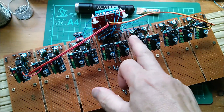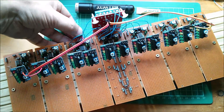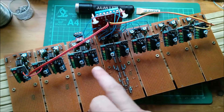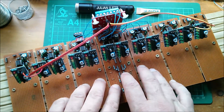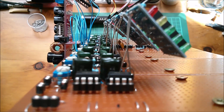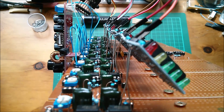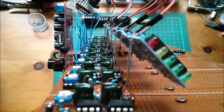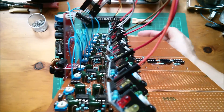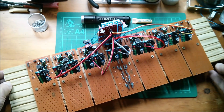Right, I think all my positive and negative 12 volts, my grounds, my input signals are all wired up. I've got a little plug-in jack there that I can put my audio signal in on. I just need some dupont connectors now to link five volts to these six bar graphs, because I'm only going to power these three boards up initially in case I've made a mistake. And having lifted the camera up a bit, how about some gratuitous shots from one end — because well it's a beautiful thing isn't it? Look at all those capacitors and integrated circuits, op-amps and resistors and pots and things to twiddle. Yes, it's a thing of beauty.